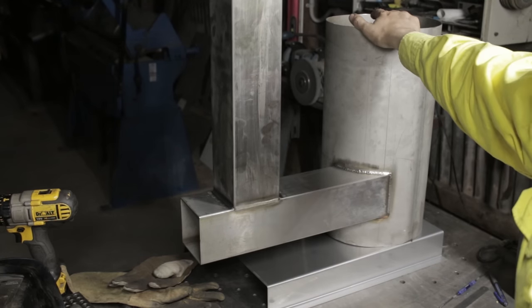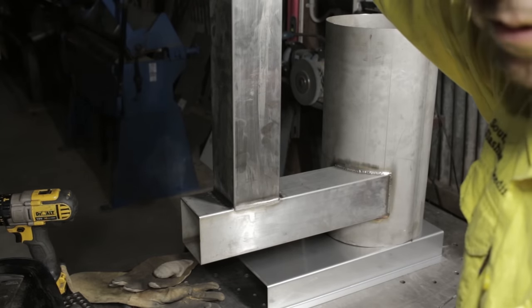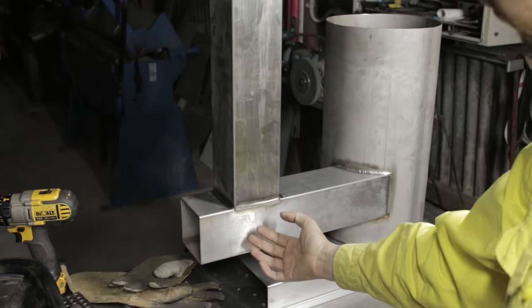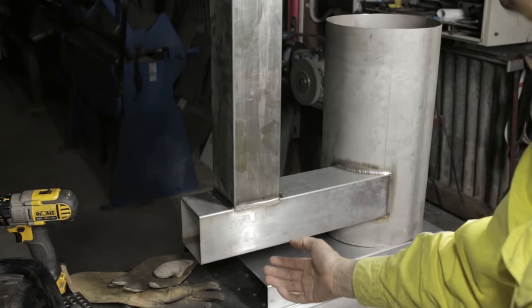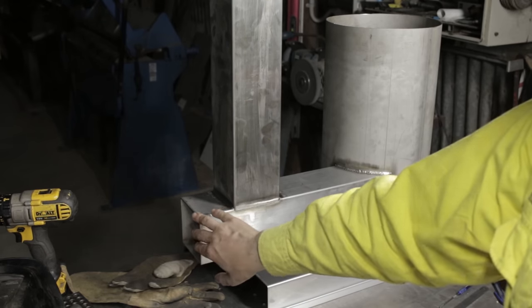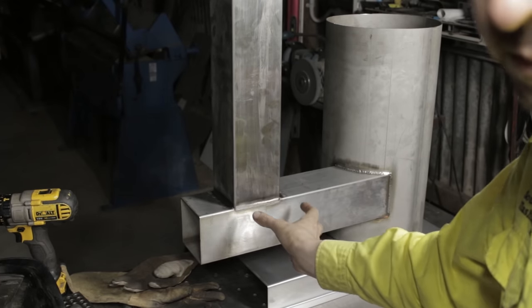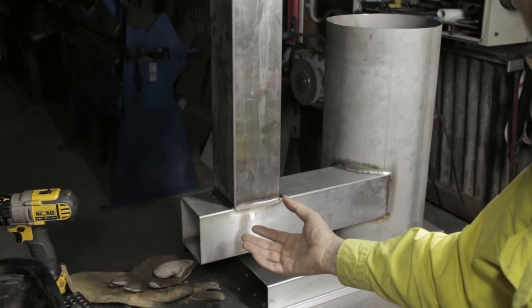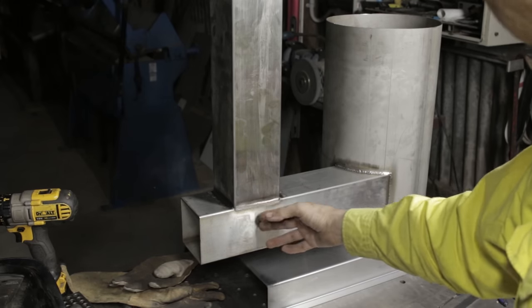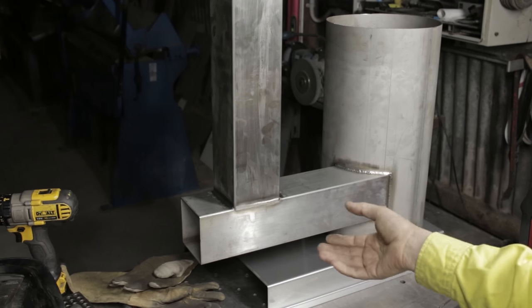So there's a little bit going on here. Obviously this is where we're going to be melting stuff, and this is going to be the hopper. I've got to put a really good lid on this thing because if I don't it's just not going to work. This will end up becoming the main riser — the fuel will catch fire here, and the air is going to want to travel in the path of least resistance straight back up. That's not all we want, which is why this is going to be fan forced. It's going to be blowing through the prison bars — I don't know what else to call them — across there, which is going to keep the fuel where I want it, not falling out one way or blowing the other. Because it's fan forced, I'm fairly certain we're going to get pretty much perfect combustion. Whatever soot or ash builds up is hopefully going to get blown into the actual furnace. We are 80% of the way there.